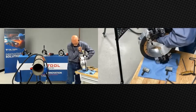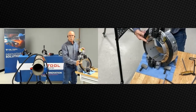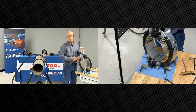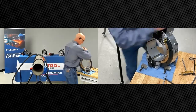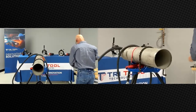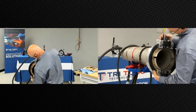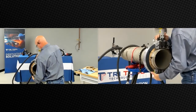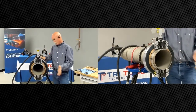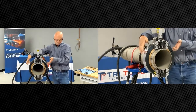You'll notice that even with the full support pads in, you still have the split lines lined up, so this clamshell can still be split in half and go on the run of a pipe instead of just over the end. So we just split our machine over the pipe. If you put it in line, you could split this in half with the four bolts — two headstock, two mainframe.